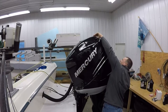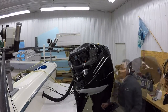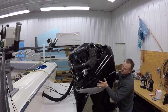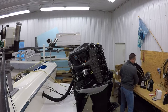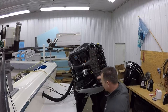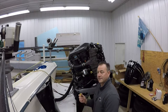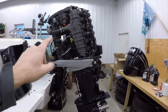Alright, this top — there's a latch, lift that, pull up, disengage it, comes right off. To remove this back cowling, it's a lever right there, then this thing kind of slides back. Flex it out a little bit to get it around the motor and that pulls up. So now we have the cowling off the top. Take the chap off, set it in a safe place. You want to do the same for the other side. Now you can see the motor with the chaps removed and the cowlings removed.